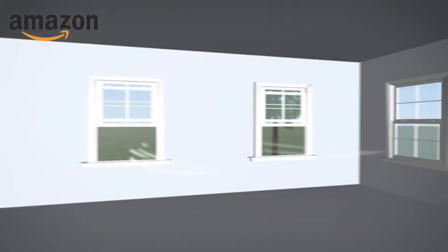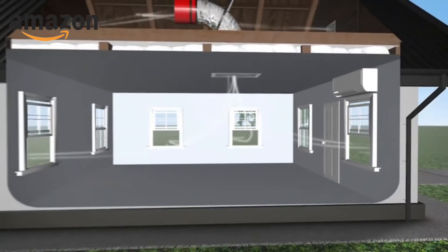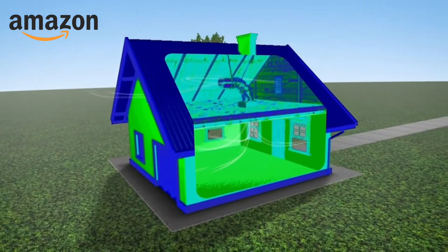When you wake up the next day, the thermal mass of your home and attic will be the same temperature as outside. The science behind whole house fans and thermal mass cooling is simple. Use the cooler, readily available outdoor air to ventilate and exhaust all of the heat in your home and attic. By doing so, you cool the thermal mass of your home as opposed to only cooling the ambient air that is getting recycled with an air conditioner.